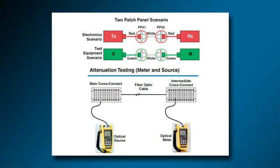When performing an attenuation or link loss test on a fiber optic system, one must make sure that they have the appropriate setup. Over the next few minutes, I will go over the steps required to manually configure the OTS 600 test set for testing a multi-mode system 62.5 with patch panels on either end.